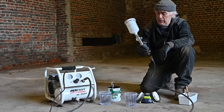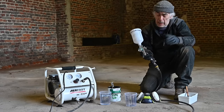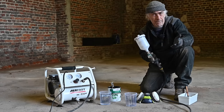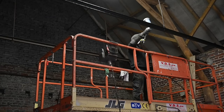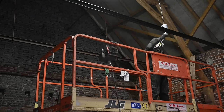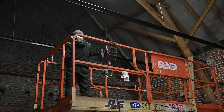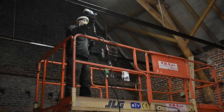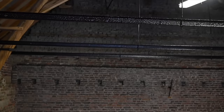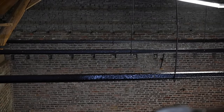While painting the beams with a brush I noticed the brush was getting worn out very quickly. That's because the iron beams are fairly rough even after shot blasting, and they are also pitted, making it extremely hard to fill up all the little pit holes with a brush. So I'm going to change tactic and use my spray gun to paint those steel beams. Only fools never change their mind. Here you have the beams, all nicely cleaned up.